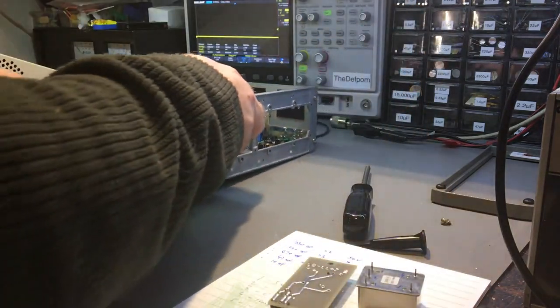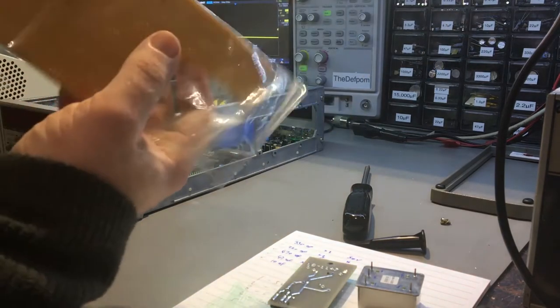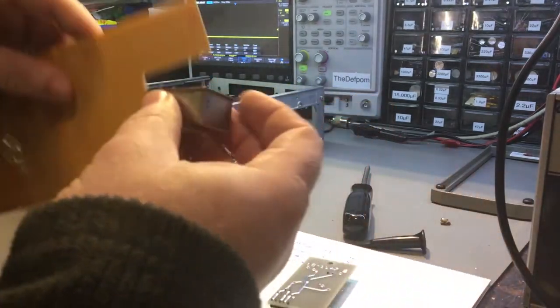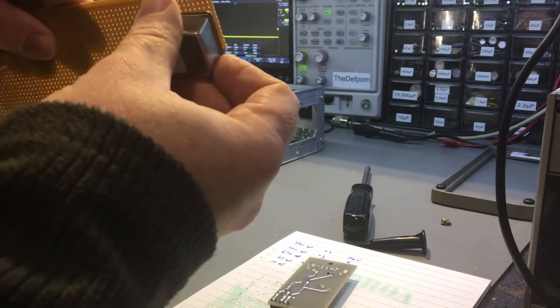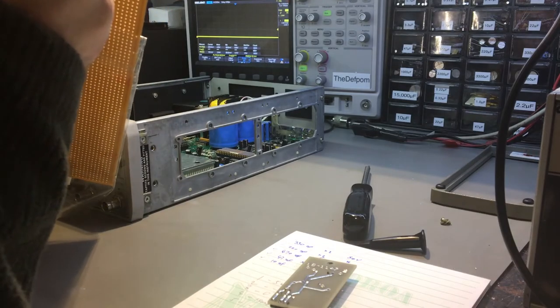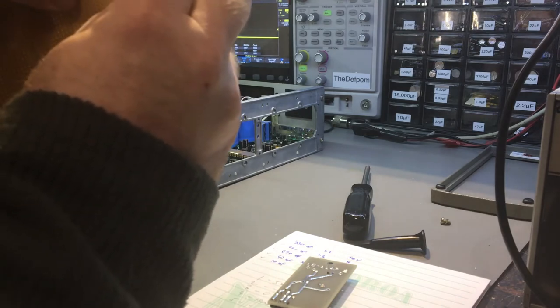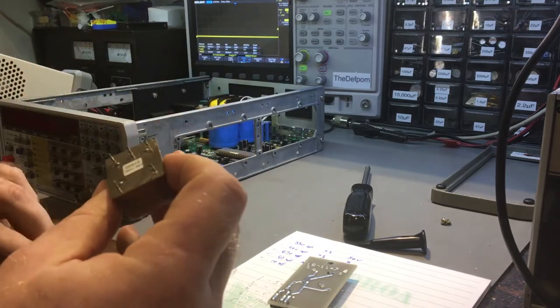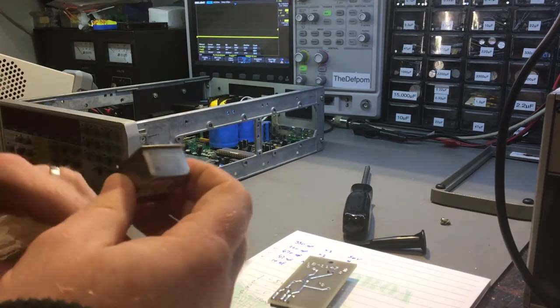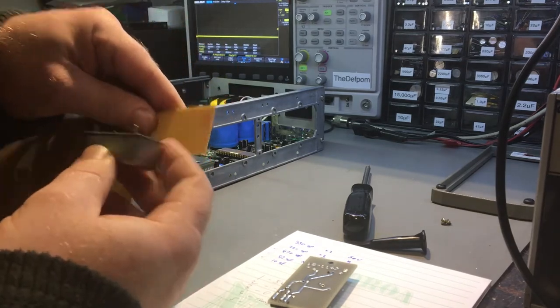So I have some perf board here - hopefully the pin-out will line up. It should, I expect - yeah that will kind of line up, but not perfectly. That middle pin is in the middle and doesn't actually line up. So I'll have to do something about that. If I hang it off the edge it would be a bit of a bodge - I can't do that. I'll probably have to make another hole. Those two unused pins - one of them was for voltage compensation, to allow trimming with voltage, but it's not necessarily used, so I'll just go for the basic three connections.